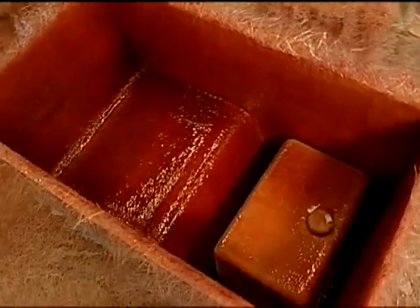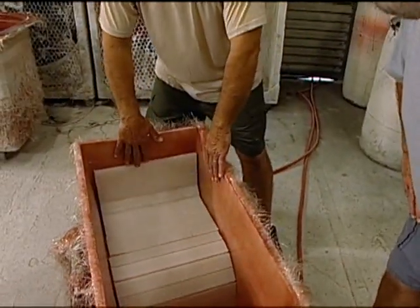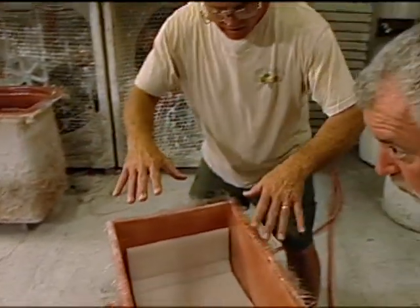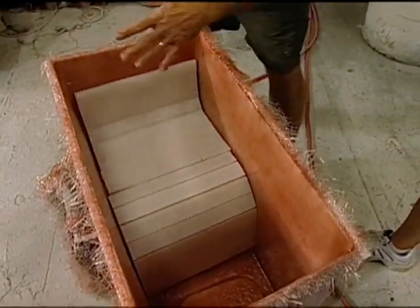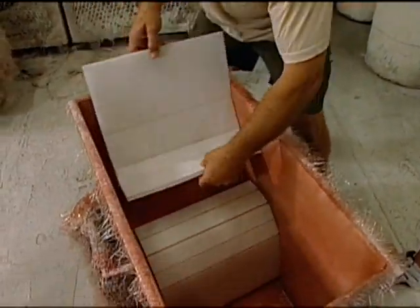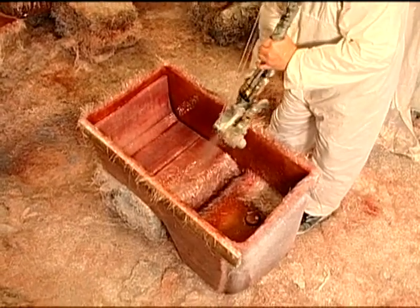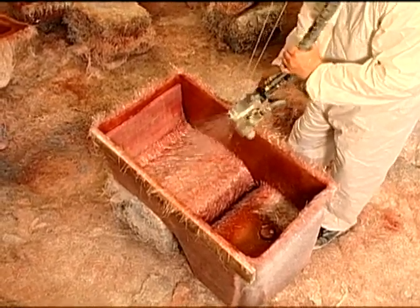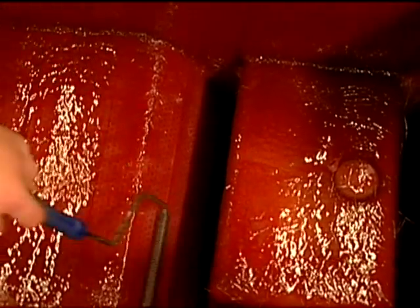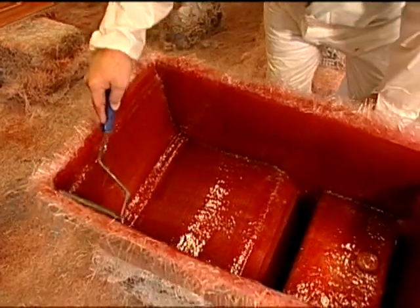What do you have back behind you, Mark? This is the other side — it's already got the gel coat and the first skin coat in there. We're going to take the bucket — your cooler — fit it and put it in this piece in just a few minutes. Then this is the Nidacore we talked about; it's already scored to match the curve of your seat right here. It fits beautifully in there, takes the curve nicely. We put fiberglass over top of that and this gives us a sandwich I-beam type of construction. Whenever somebody sits on the seat, that's what makes it strong — it's really strong but super light. That'll be our third coat, covering the whole thing and tying it all together.